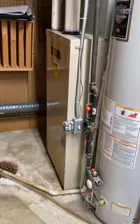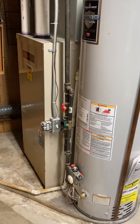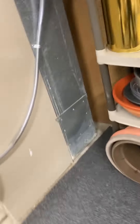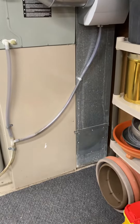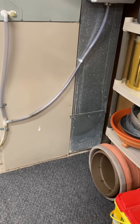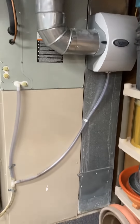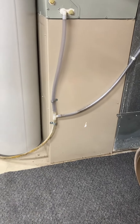What I'm going to suggest is with the new furnace, we come back with a base. We can get the same width that'll match up with the coil. We do have a newer humidifier. Right now the filter's inside the furnace, so we'll be able to improve on that by getting a media filter on the side — we'll update the return drop, fit a media filter on the side, and then the furnace on a base.